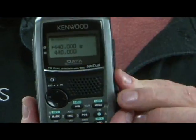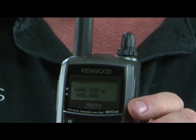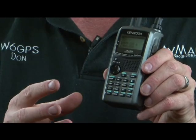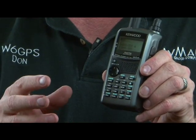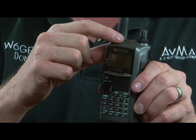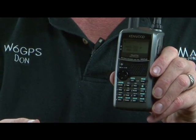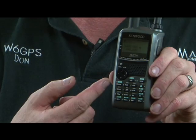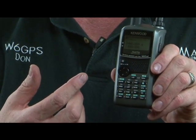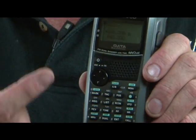Probably the most exciting feature about this radio that I've learned here at the Dayton Hamvention is the fact that it's got a logger program. There are about three different parameters that you can use. Basically, because it does have a built-in GPS, I can take my unit out, walk around, and everywhere where I make a beacon or make a mark, it records it in the radio. I come back inside my house, download the KML files to like Google Earth and other programs that use KML files, and I can actually see where I've been.